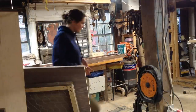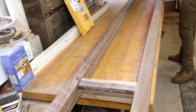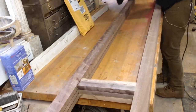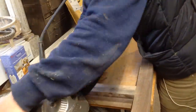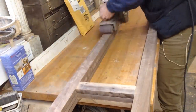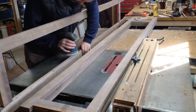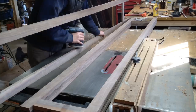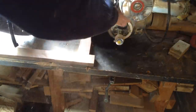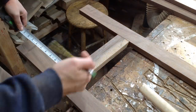That's going and putting clamps on the other side — you can see the bottom stack is already clamped. I waited on all of these at the end and let them dry overnight. The next day, to clean up all those burn marks, I knew there'd be a ton of sanding on this piece so I tried to do it as I went. Since the frames stuck together slightly from glue, I kept them stacked so I could sand them easily with the belt sander without them moving, then flip and sand the other side with the orbital sander to remove all the burn marks. I'm using about 80 grit. Then I cut the tops down to size.